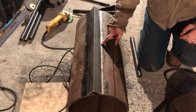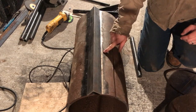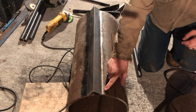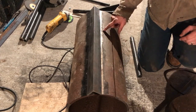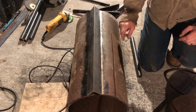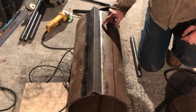I have done thick like this before and it's held up, believe it or not, with that little welder. But the only way you're going to get it to work — it doesn't make very pretty welds, but it's perfect for tacking. You've got to clean it really well. Any mill scale, anything like that — this pipe has a pretty good layer of it on there, and that has to go. Clean the edge of even your new metal. That has to go.